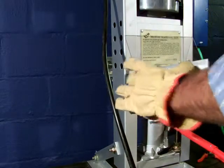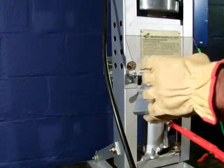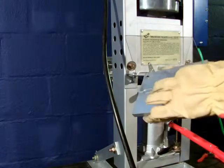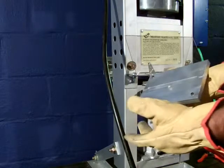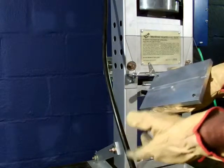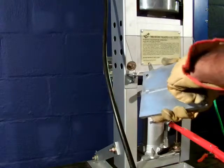The plastic flows naturally without any packing pressure. Packing pressure occurs when you have the cavity closed in and the machine packs in under a lot of force. If the plastic flows in naturally like this, it is more suitable to perform tests — for example, this painting test, or any other mechanical or fatigue testing.